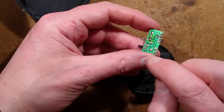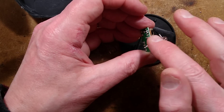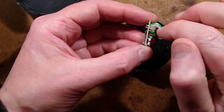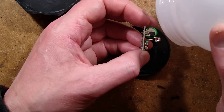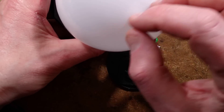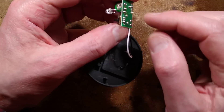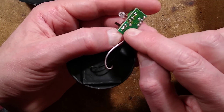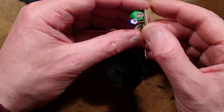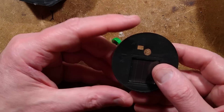This is now glowing icy blue at a low intensity. You have an option now that you've got the cover off — you can slather it with either Vaseline or nail varnish to try and make it waterproof. Run some up the leads to the LED and around the battery contacts and up to the end of the chip — anywhere water could build up. Water gets in around the side where it screws in, condenses on the inside, and drips down onto the circuit board. There is never any escaping water. The switch is one of the most likely things to fail — you can just bridge the two pins with solder, which will keep it on all the time and prevent corrosion. If you've had lights fail, suspect the switch and also suspect the solar panel.